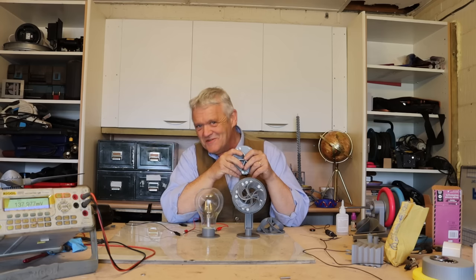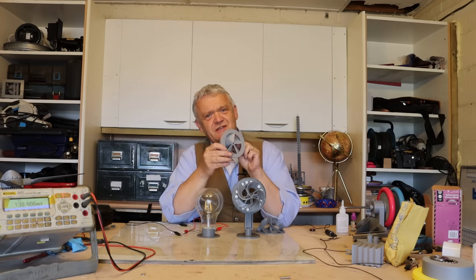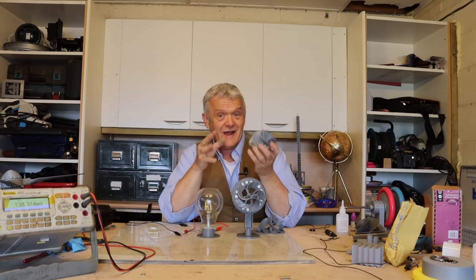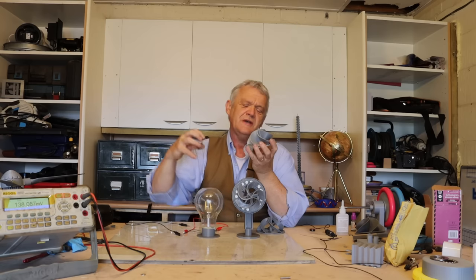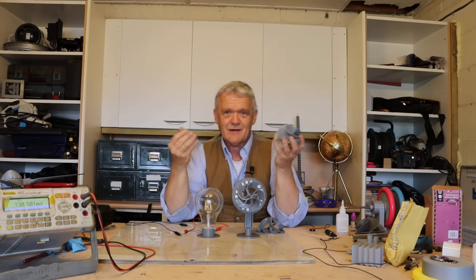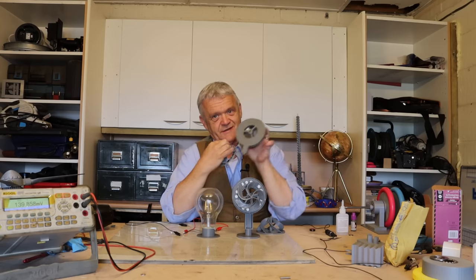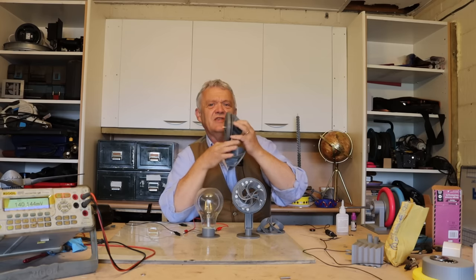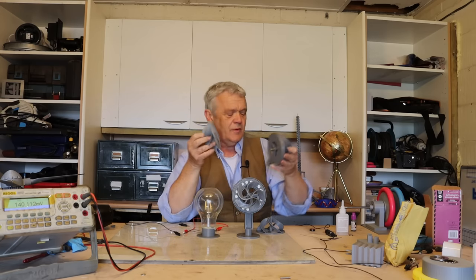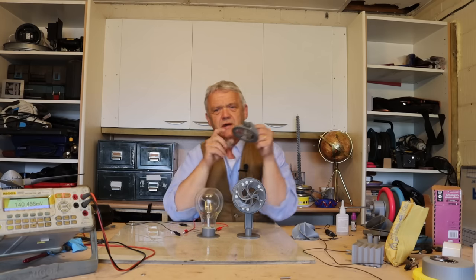If you remember the first one, the blades were solid and there was an exit hole at the bottom. Effectively what that makes is a drag type turbine — the wind hits it and it's the force of the wind hitting it that pushes it around, and then there's an exit hole. We had two of those, there's an exit in there, and it was hitting this, and we were getting extra out of that as the wind exited — which is also why they had to be mirrored.